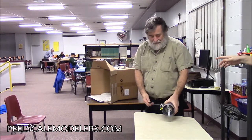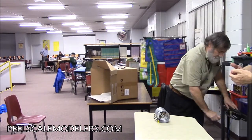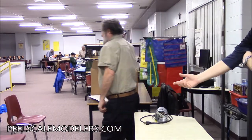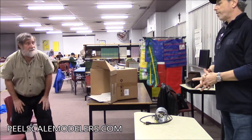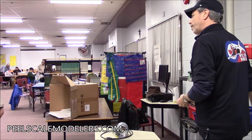So that's something, if I can just interrupt, I also wanted to bring up, so I'm glad you did. A lot of people are taking kitchen hood fans and turning them into spray booths. But if you're a car guy and all you're doing is using lacquer spray bombs, you could potentially be setting yourself up for either a blow-up or a house fire. The fan that I'm using, I'm not absolutely sure it's brushless. You might be able to answer that better than I can.